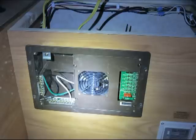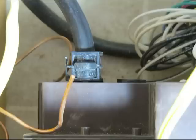The nice thing about the converter is that it comes with its internal wiring wired up, so you only have to do all the other wiring. So you see the white wire and the green wire are the converter box's wires. And so you just match that up with your wires from your shore power. So feed your shore power cable in through the back and anchor it to the converter box. As I said, I used the anchor and cable protector from the old one.